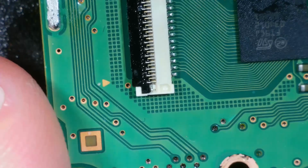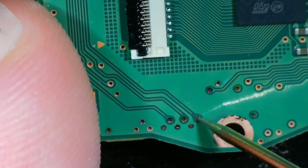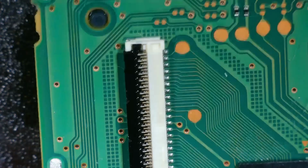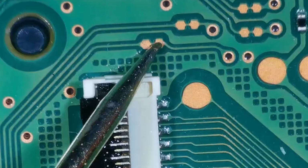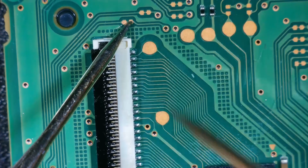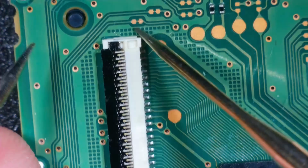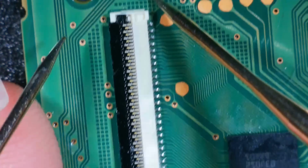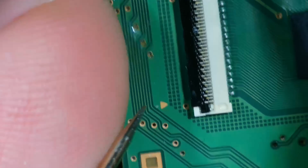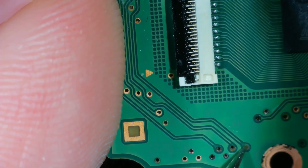Right, let's try the beeping device. So let's put the probe in this one. Where does it go? Well, it goes to these test points here. Nope. It's not doing it, is it? So from that test point, let's follow it round. Round, round, round. To there. Yeah, it's not getting there.